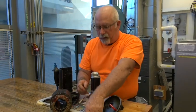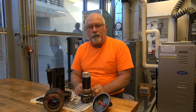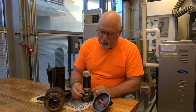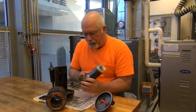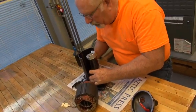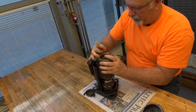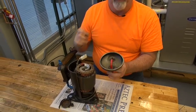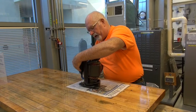Because if you forget that, you could be here for a while. Remember that there are always two parts to a compressor: the electrical side and the mechanical side — we're only concerned about the mechanical side at this present moment. Don't use any tools on this stuff; we don't want to get it stuck so we'll never be able to get it out. When you go to put this back in, be sure that your low pressure side is connecting to your low pressure line. And ensure that your electrical side wiring is at the top, because there's another connector that would connect that to the common, start, and run windings. Put all the parts back so it's ready to go for the next student.